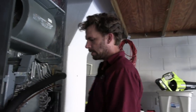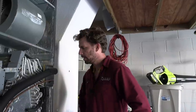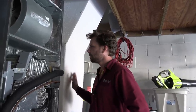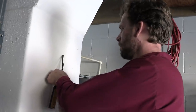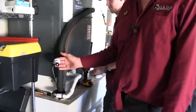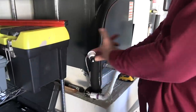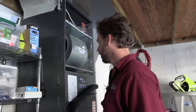That concludes the cleaning and the power-off section. Next, all we need to do is turn the equipment on in cool mode and do a really detailed checking of the refrigerant and air temperature split, making sure the system is actually running right. Looks like we already have an access hole for checking our air split. When I turn the system on, I check the float switch to make sure that opening that up kills power to the system. I'll run inside and confirm that the thermostat has shut off, or wait an extra 30 seconds for the blower delay to make sure that turns off.